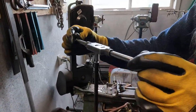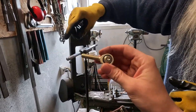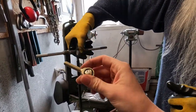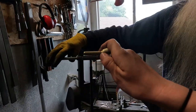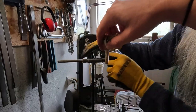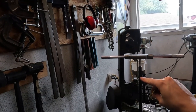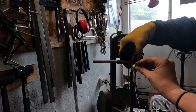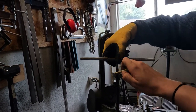My dad has just finished running the tap into the first end of this steel tubing. We're making sure to run the tap in as far as it can go so we can get a deep thread on there and use the majority of the thread on this rod end. We'll be able to thread that in as much as it can go, with a lock nut threaded all the way to the top of the rod end to lock it in place. That also gives us a little bit of room for adjustment — about half the length of the thread to work with.